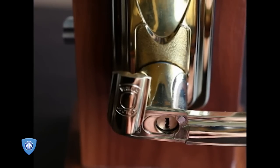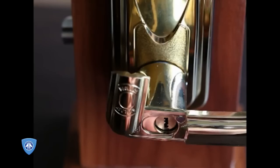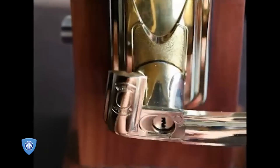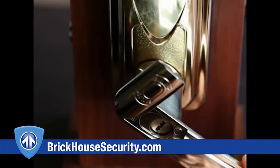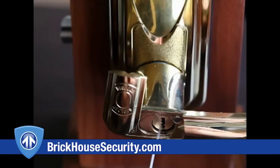This is a macro shot showing exactly how simple this BioLock 333 is to bypass. The keyway is exposed on the bypass cylinder. Let's first show that the lock right now is locked — you can turn the lever and it has no effect on the bolt. We insert the paper clip straight back in the keyway, depressing a pin that engages the latch, and you can see that the lock is open. This is an absolute perfect example of insecurity engineering.